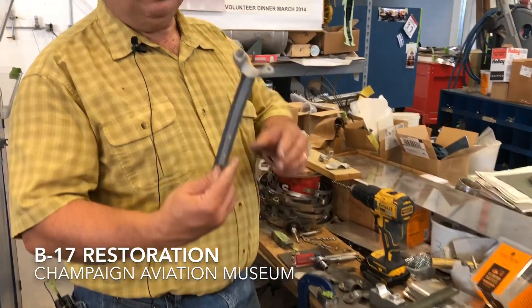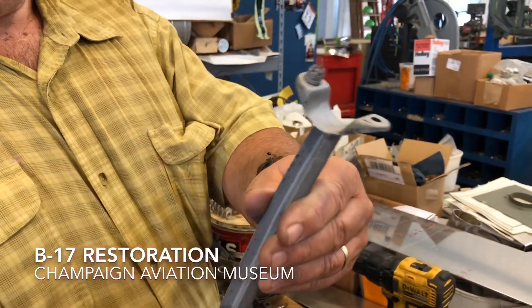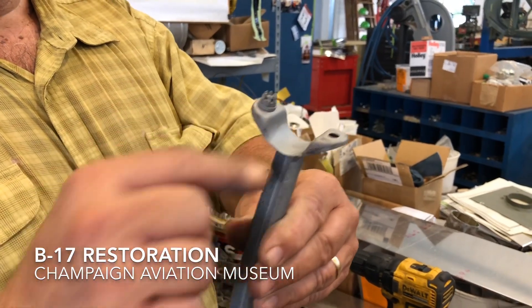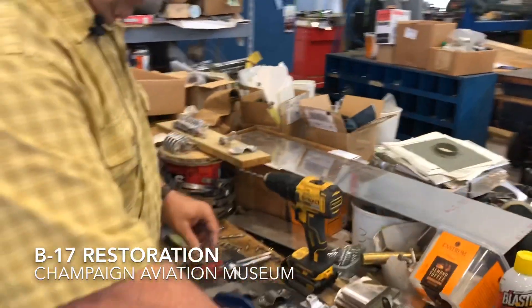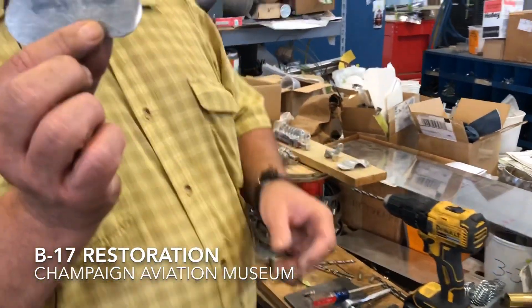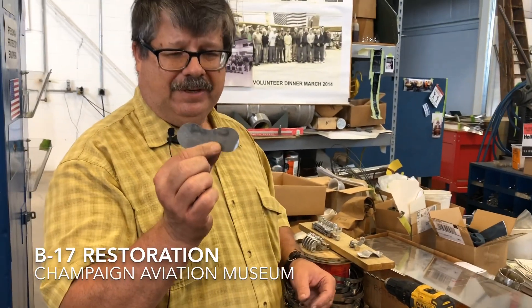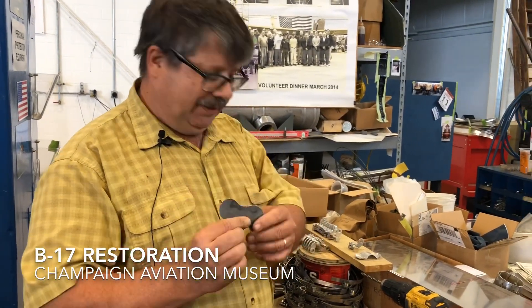Here's an old piece here, and these pieces have already been made and we're working on this top piece. We take a piece of sheet metal and cut out a dog bone. We have a paper pattern we trace off to cut this out and smooth out the edges.